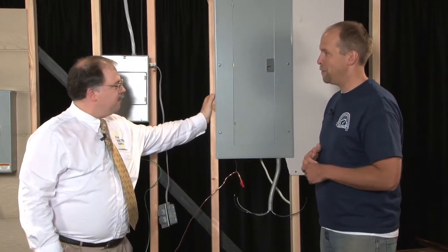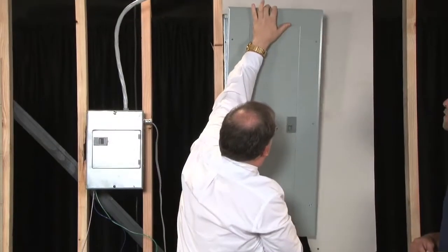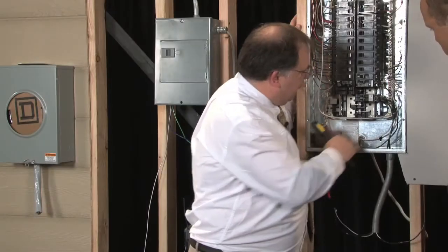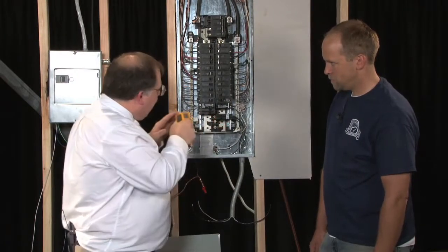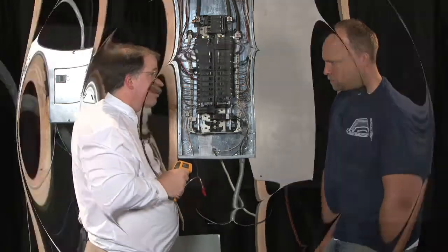Sure. Where do you want to start? Well, the first thing I'd like to start — pull it straight out, and see how I'm keeping it all in front of me. The other one I see is we have aluminum. Now, when I use a tandem breaker like this, or two-pole breaker, and I do a multi-wire circuit, if it's a poor connection, I might have a situation where I read that breaker a lot higher than any other one's.